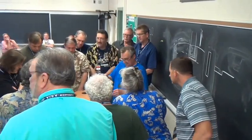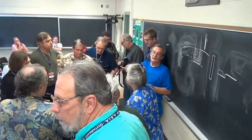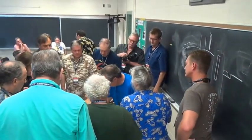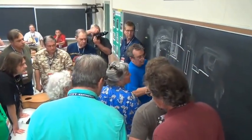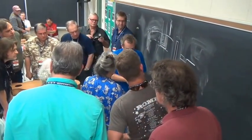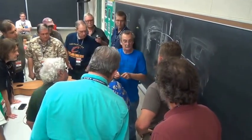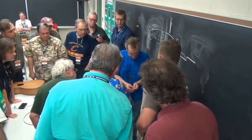Okay, so you're just creating a border around the tongue of the board, right? Exactly. And what I'm doing is I'm taking all of this material. Okay, I gotcha. So I take this material and I take a piece of pearl, this long piece of pearl, and I cut into a board, lay a piece of wax paper. I put my black and white against here, right? And I put my pearl in here. So I have my black, white, black, and I have my pearl. And for sake of discussion, this wonderful piece of tortoise has turned black, right? Sure. So we put that together, and you super glue that together. Okay. Now you got one piece.